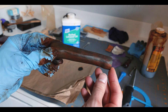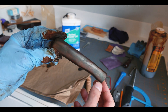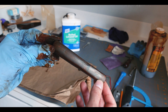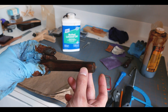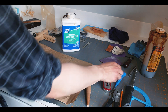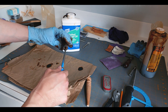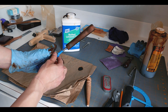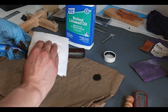So I went ahead and dyed the entire handle with the leather dye, which took beautifully. It ended up a little darker than I thought it would. Now I'm going to go back over that with the boiled linseed oil — maybe do a couple of coats. It actually dries very quickly and doesn't stay tacky for very long. I've put the handle on an awl point so I can do the entire thing without getting my fingerprints on it, for nice even smooth coverage.